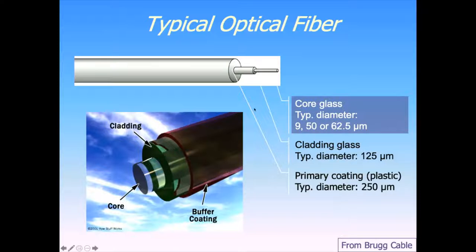Typically, optical fiber has two kinds of glass in the center, and then some plastic coating over the outside. The center we call the core — that's where most of the photons are transmitted and travel down the optical fiber. Around that, basically fused to it, it's made as a continuous fiber with two sets of glass. The outer glass we call the cladding glass, and that ranges in diameter from roughly a hundred microns down to about 50 microns, depending on the kind of fiber.